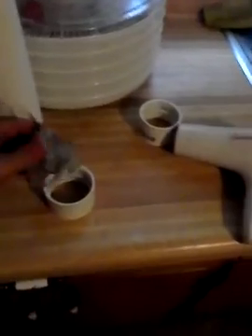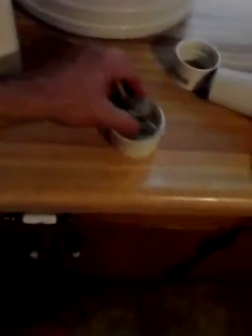The way this works is I cut the teeth off by heating up a knife on the stove. As you can see, it sets in there quite nice. The problem is this two-inch PVC DWV piping I'm using — it slides right over the fan but isn't big enough to cover the frame of the motor. So what I had to do was cut the ears off, and it goes in pretty snug; it's not going to vibrate out. There's a plastic molded ring — you put your PVC pipe in there and it pushes up to the molded-in clip, snaps in nice and flat.